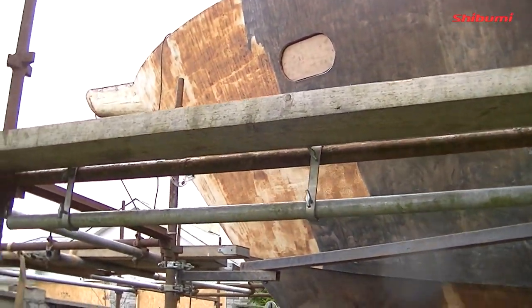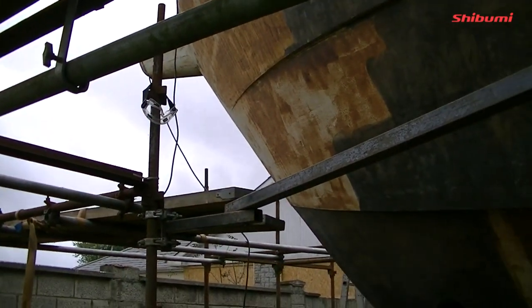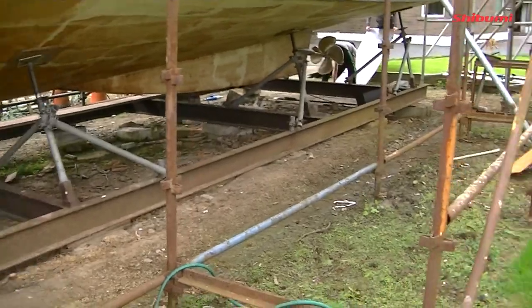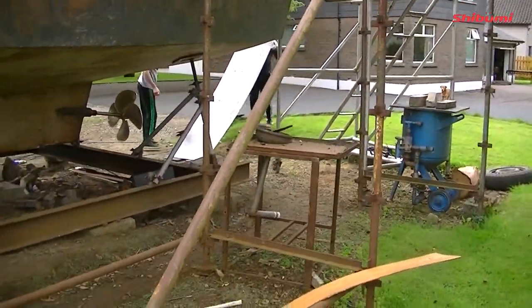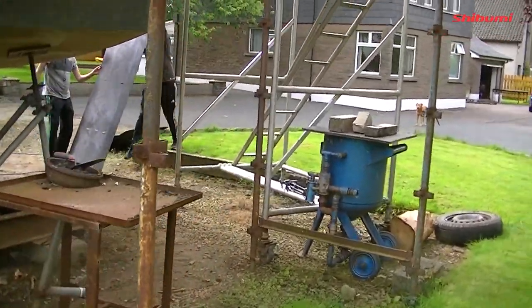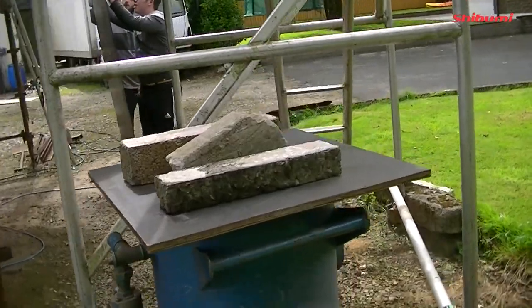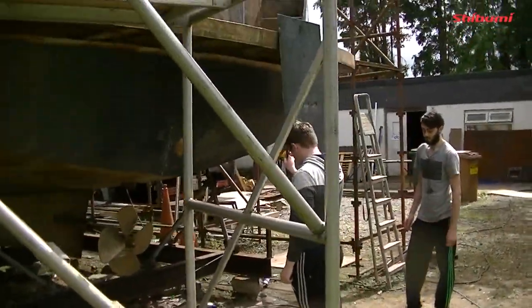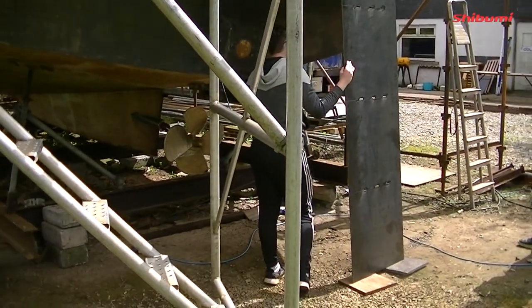So we have this scaffold arrangement with a bar that we can put planks across. We had the exact same system 10 years ago. So I'm going to go welding the first of the tanks. The top of it has literally just landed over, as we can see. This is purely accidental and not a staged version of it. But that sheet's going up, and it's the top of the tank. I'm going to tack it on, then flip the tank over and solidly weld it up. It's going to take a couple of hours.